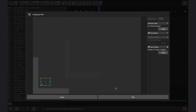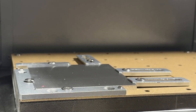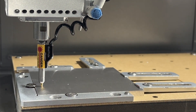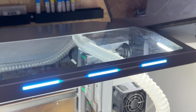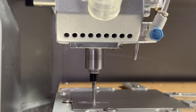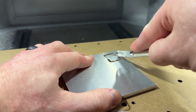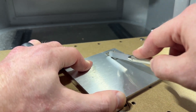The Carvera Air will again prompt you to load the wire probe and trace the perimeter of the part using the laser pointer. Ensure the laser does not overlap with any screws or clamps. The Carvera Air will then measure the Z height across the stock. After measuring, the Carvera Air will prompt you to load tool 4, the 1.2 millimeter single flute end mill, before beginning to machine the switch, which will take about 20 minutes. Once finished, carefully vacuum away any excess material shavings, remove the part, cut the tabs using a handsaw, and use sandpaper or a file to even out the edges.